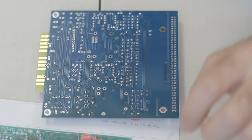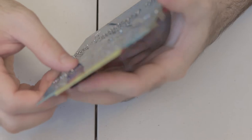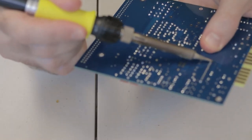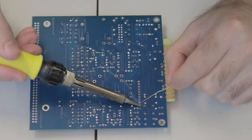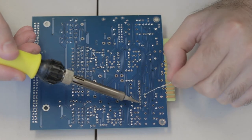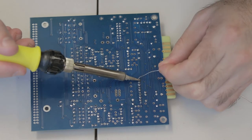There's another connector here — the socket for CN4A. Do the same thing: put a bit of solder on one leg to hold it in place, check it's all nice and straight, then go ahead and solder all the legs to the board and give them a snip.